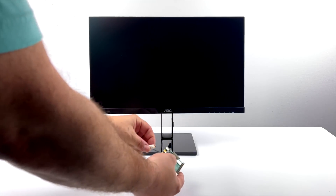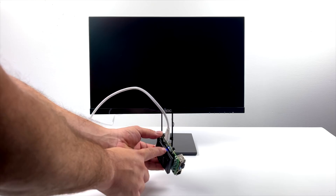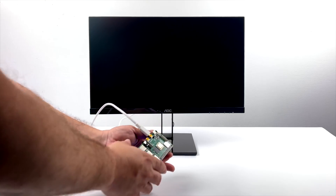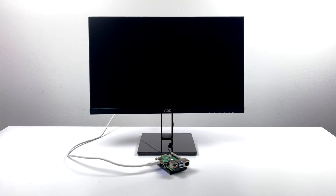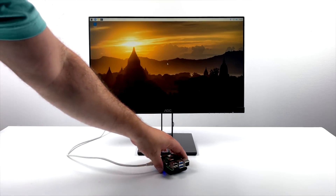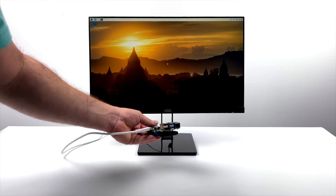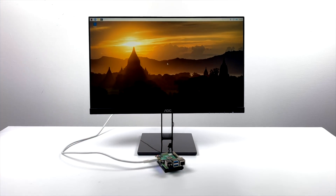I'm running Raspberry Pi OS on this Pi 4, and the only thing I'll need to plug in is HDMI since I'm now fully battery powered. We have that LED indicator and the unit is now booting from a 32 gigabyte micro SD card. I've recently been running all my Raspberry Pis from an SSD and the boot time is so much quicker than SD — I forget how long it takes. But here we are on the desktop running on full battery power. I've got the PiSugar S Plus fully charged and I'm going to run it down by doing some video playback — opening Chrome and doing 720p YouTube playback to see how long it lasts.